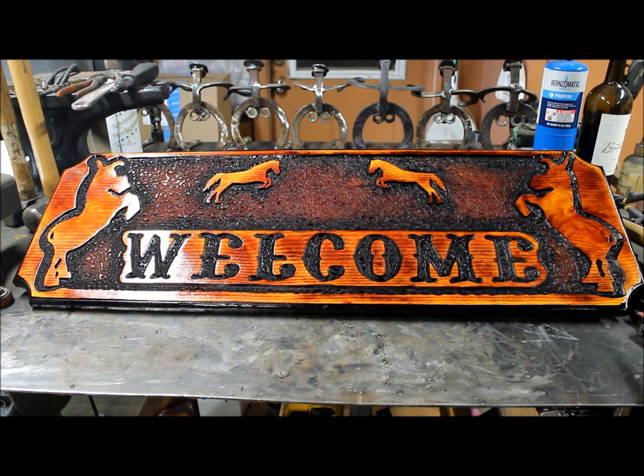You don't need all of them, of course. They're a little pricey, but it goes a long way and lasts a long time. So I like using them, especially if you can tone things. If you have lacquer and you're using a little sprayer, you could put a drop in there and it'll change the color slightly. So you can play around and experiment with your finishes with trans tint.